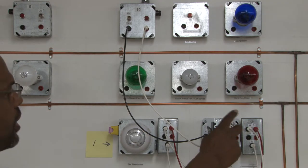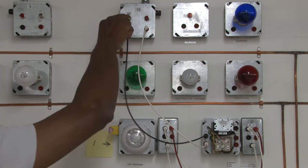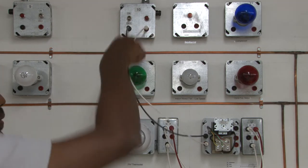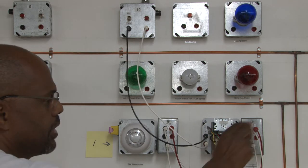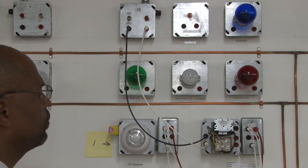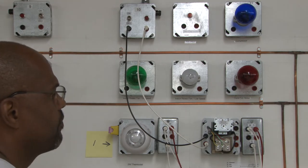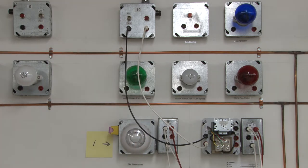The relay contacts are controlling the blower side of this. Now we have a schematic showing how to wire in the power source going to the primary side, coming out of the primary side at 24 volts, going to the thermostat, going out of that, and going to control a light bulb. All we need to do is wire in the terminals for the light bulb — the load that we have.